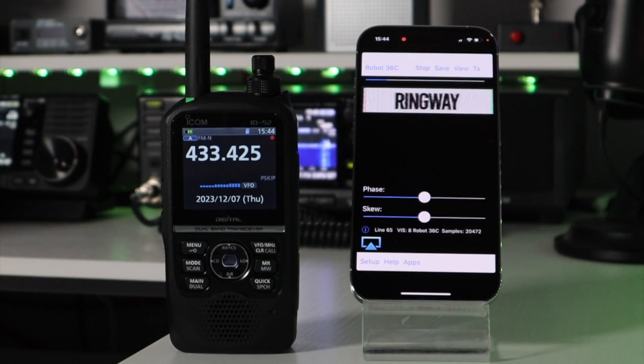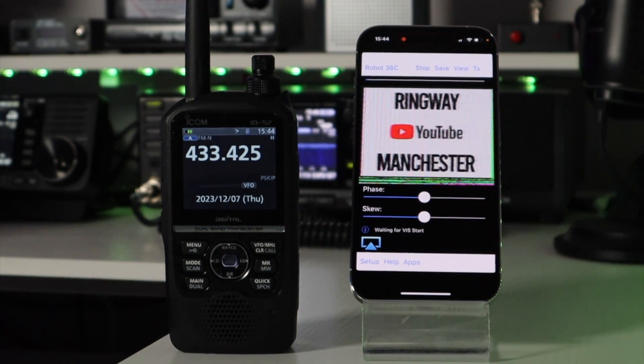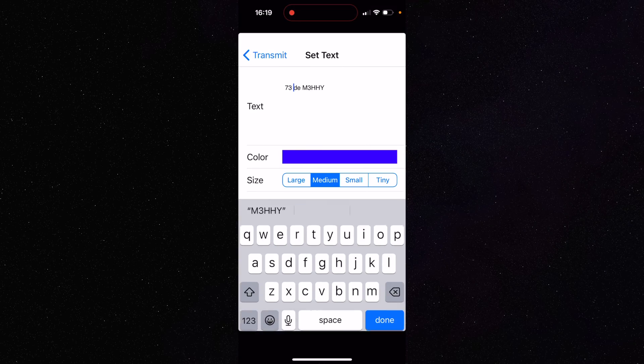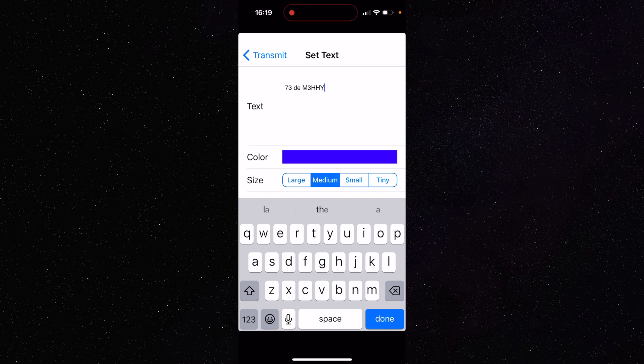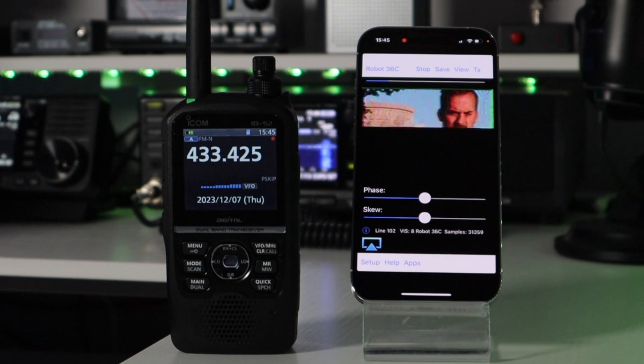If you're a licensed radio amateur, you can also send SSTV images using HF equipment or a VHF/UHF handheld together with the app. All you need to do is load up an image in the app itself, add any text that you want, and send it by holding your phone speaker next to a two-way radio. It can take a bit of fine-tuning, but I found full volume close to the radio speaker seems to work best. Someone on the receiving end can then decode your image.